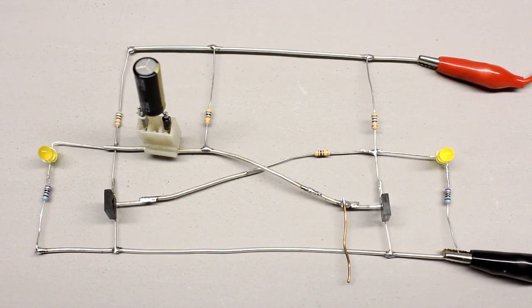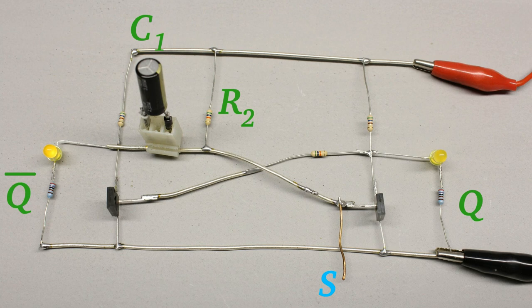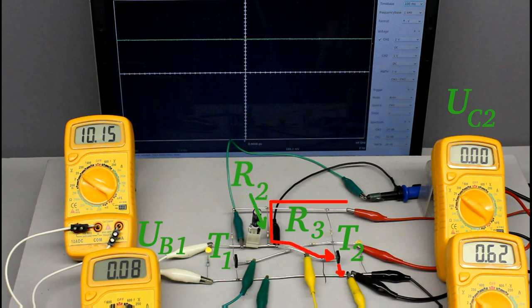The circuit is altered slightly — it is called a monostable multivibrator. The coupling resistor at the base of the right transistor has been replaced by a capacitor, while another resistor is connected between the positive terminal of the supply voltage and the base pin. Just one switch is required to set the output Q; it is reset after a fixed time span. At the initial state, the right transistor is turned on, by which the base voltage of the left transistor is pulled to ground via coupling resistor R3, hence that device is turned off. The base current of the right transistor runs from the positive terminal via R2, keeping that state of the circuit.